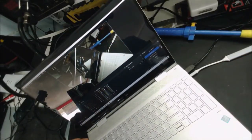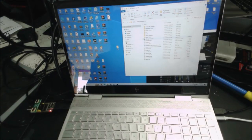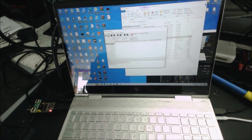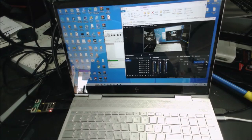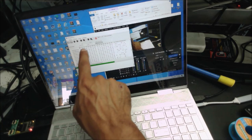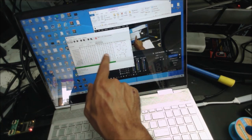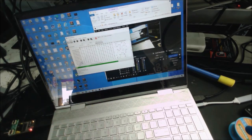Let's go to the computer. That's the IC. We go to read — it's going to take a minute. After the program reads the EEPROM, I'll click verify to be sure what the programmer read matches what's inside the EEPROM. This page matching what is inside the EEPROM is very important — always do the verification.